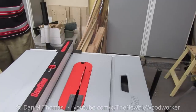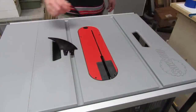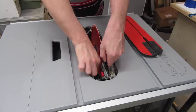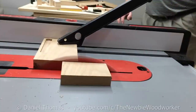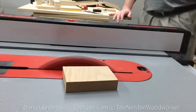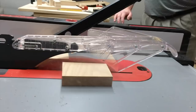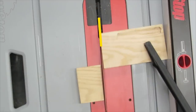Obviously, we can never completely prevent unexpected things from happening, but we can certainly improve our odds. Preparation is what we do before we make any cuts. For example, installing a riving knife and leaving it there. I've yet to encounter a situation where I had to remove the riving knife, other than to use a dado stack, or shoot videos like this. If you know of a situation where you need to remove the riving knife, please leave a comment explaining it. This kickback happened because the rear teeth on the blade grabbed the stock. If we had a riving knife installed, the board couldn't have touched the teeth long enough for them to grab the board. Same thing if we had used a blade guard. There are other attachments to help prevent kickback, like anti-kickback pawls. What other anti-kickback attachments do you use? Leave a comment and let us know.